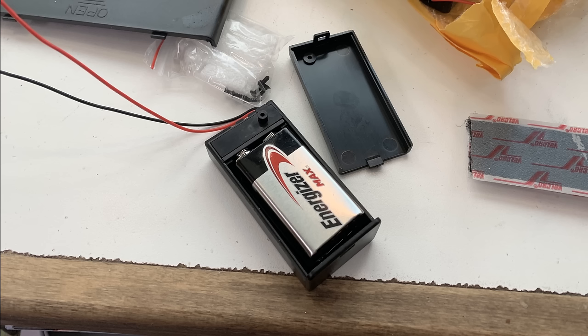Yeah. Well, as the Mythbusters would say, here's your problem. These little 9-volt batteries are not only not providing the full 12 volts that the screw-in LEDs are rated at, but they just cannot keep up with the amperage that this whole thing is pulling. The battery itself is heating up. It also goes dead in about 45 minutes.